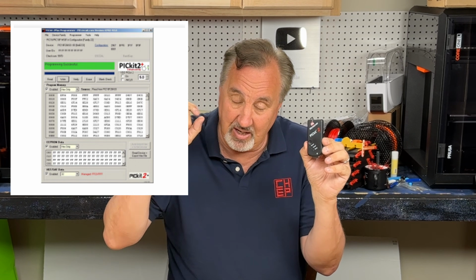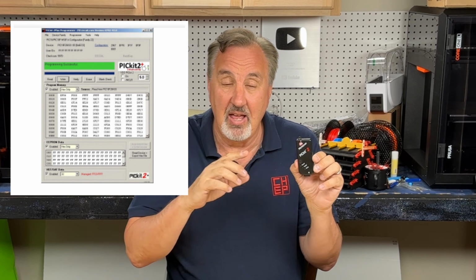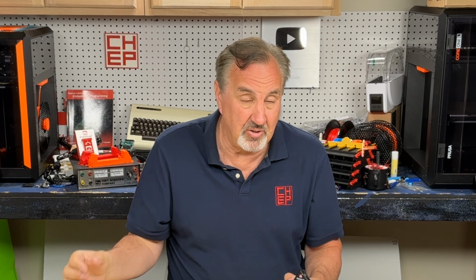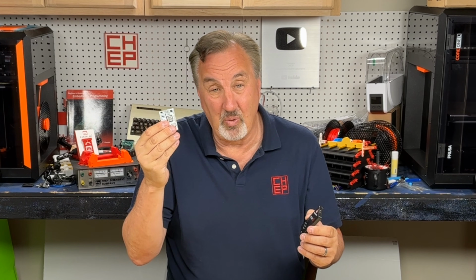But you've got to download a whole MPLABX environment because all the code is embedded in there. So you're going to download a bunch of code for an IDE that you may not even want. So it's taking up space on your hard drive. The PICkit2 is really simple. It's an independent application to drive it. And it's got other features like a built-in serial terminal. It's got a logic analyzer and a few other features that this program won't have.